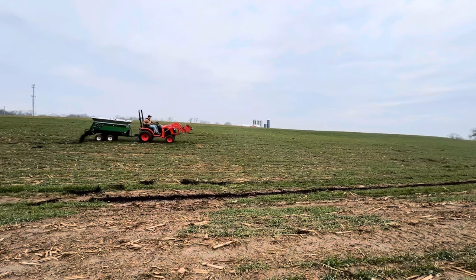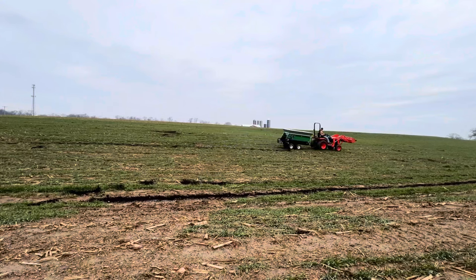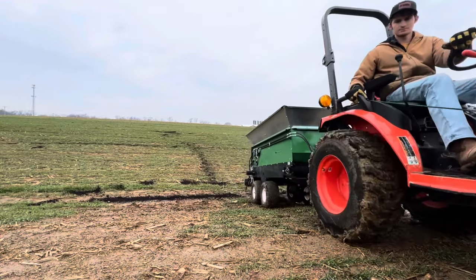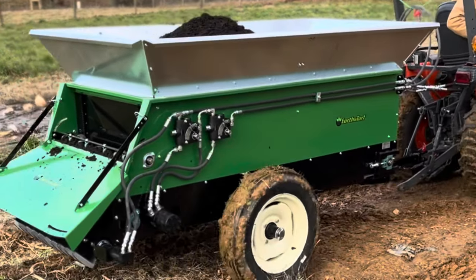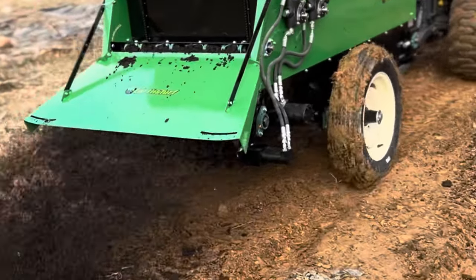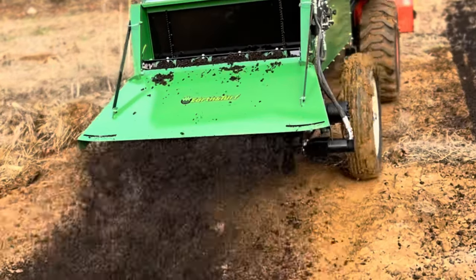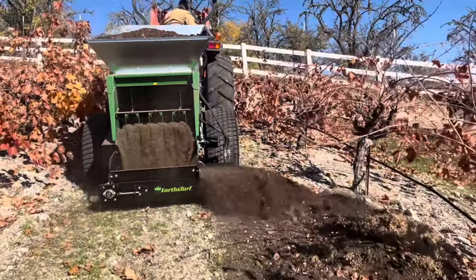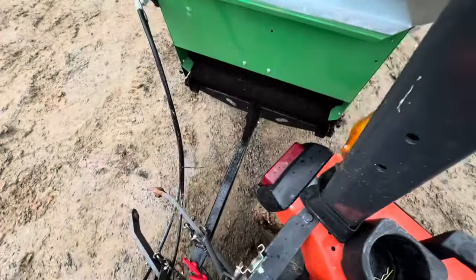The tandem walking axle has two features and two things it's not as ideal for. The features: it's definitely narrower — only a 39-inch outside-tire to outside-tire width — so that's ideal for tight rows. And it contours your bumps and hills very well because the axle walks. However, on the downsides, it's a little bit narrower which means you're less stable on side hills. And if you're trying to drop straight down onto a row, you don't have much straddle width. So if you're looking to top dress and side dress, you probably want a single axle. If you're strictly side dressing with sharp hills, you may want a wider stance single axle.